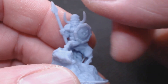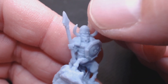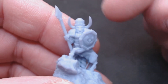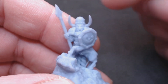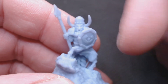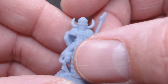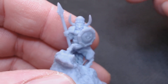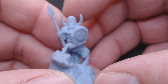I was using a bit of hot water to get them off the build plate, which is a definite way to help remove that issue. That's how I went down the rabbit hole of using the water-washable stuff — washing them in hot water so they came off really easily. But they were becoming a bit malleable and the bases were bending. So now I'm giving them a full six minutes in the wash and cure station with the IPA, which gets all the rubbish off. Then a couple of minutes under running hot water, because dealing with contaminated water is not an insignificant issue, and it also helps get them off the base more easily.